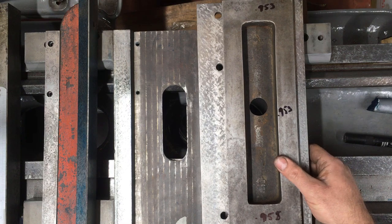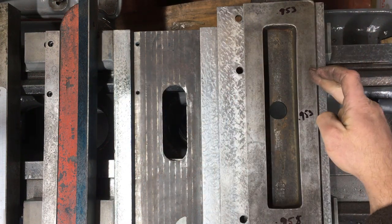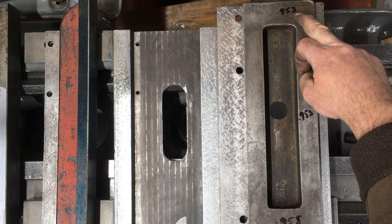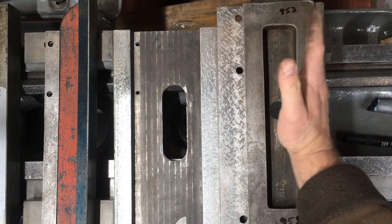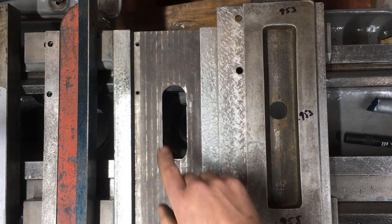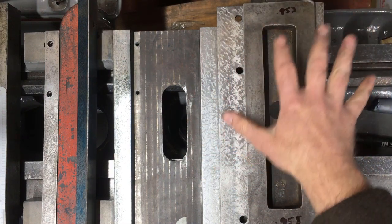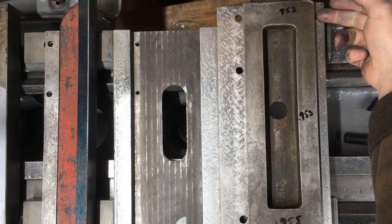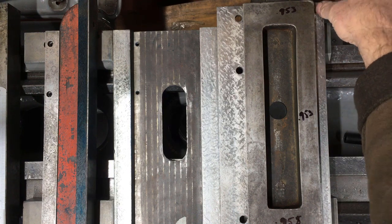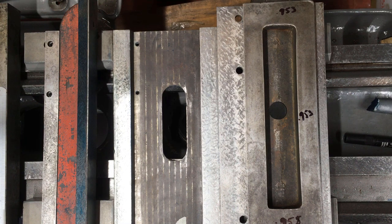So it's showing wear. Now if I want to shift that alignment that way, I've got to take material off this end, and this is already the narrow end. That's what I'm finding slightly concerning, because I can't quite get my head round how that wear's happened. But what I think has happened is the wear on the underside of these flats, and there was quite excessive in that area, and well, tapered back that way. As I've taken the thing down on the underside and then done the same on the top side, as that's gone down to bring it back to flat, it's obviously increased the gap, which would allow the pins to shuffle in a bit. So it's not actually wear on the dovetail, it's that face which has been dropped. So it has adjusted the geometry of it a degree, more than I'd anticipated.